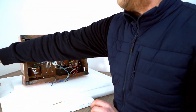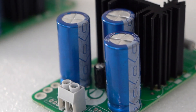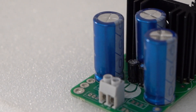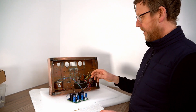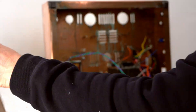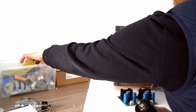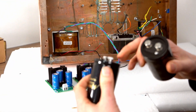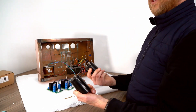The issue we have is that for the upgrade, I want to be using these filament supplies. We're going to turn the heater supply to the 300Bs from AC to DC. So the issue is that we need to fit these guys in. Plus, part of the upgrade is we're going to use these guys, which were not in the original kit, but the guy that we bought them off fitted these. I'd like to reuse them — they're great power supply caps.